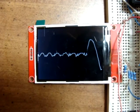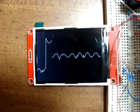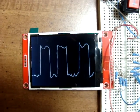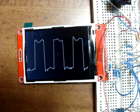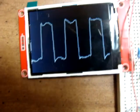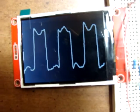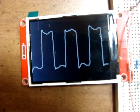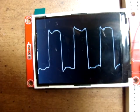That's the sine wave. There's the square wave. My square wave ain't all that square. That's probably due to something to do with the filter capacitors in the analog input section. It could even be the negative noise on the negative supply. Interesting that the square wave isn't that square.